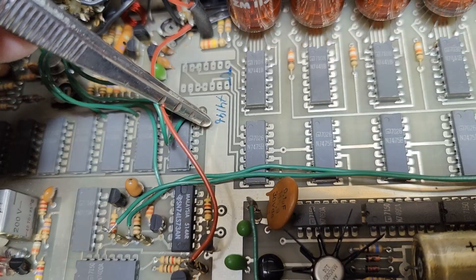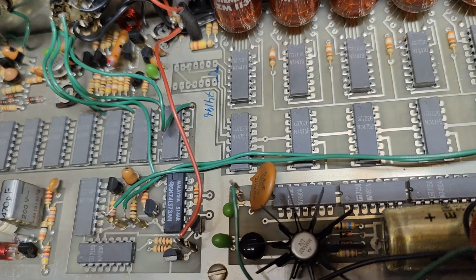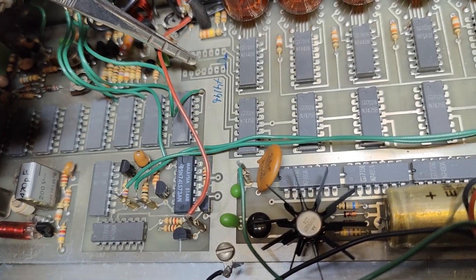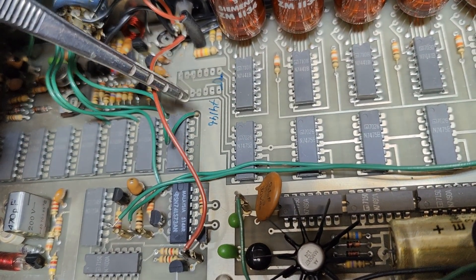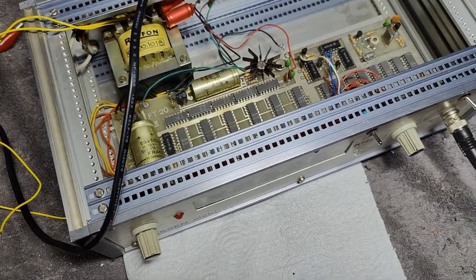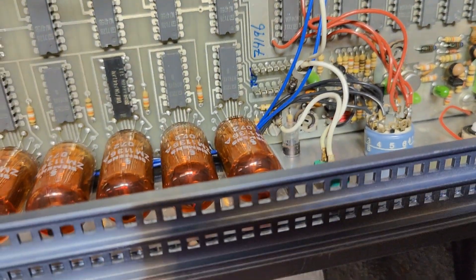This one is a 74196, nicely written on the circuit board. I went to the peel.dk website and looked up the schematic. Clearly enough, this is the first counter — why is the first counter made differently compared to the next ones? I find this a little bit weird, but this is how it is made. The good Peter from peel also gave me another one to look at — I've got two of these in my lab today. And the other one is also missing this IC. There is a socket, and this one is also not working.